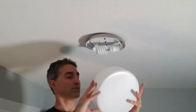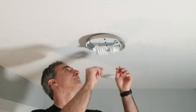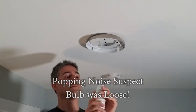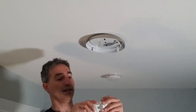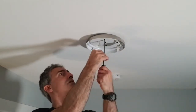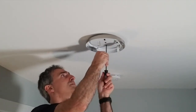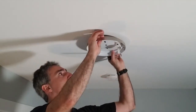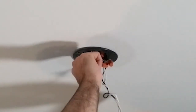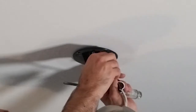First, let's get this old fixture down and out of here. Make sure power is turned off. This is one of those dual-prong compact fluorescent fixtures - yuck. The first thing we're going to do is loosen up these screws, which typically attach directly to the ceiling-mount electrical box. That one wasn't even fully seated. I'm going real careful in the box as I assess the wiring.